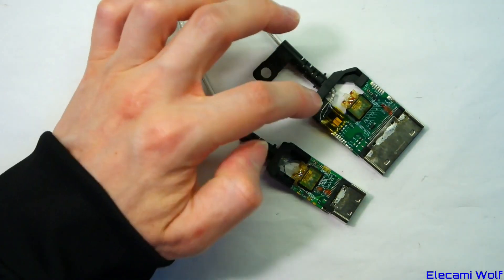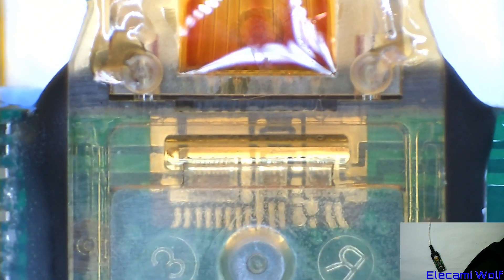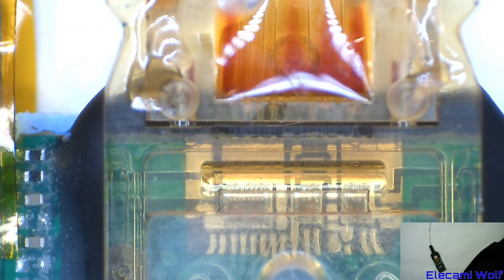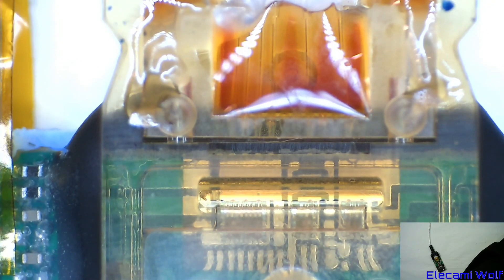Finally, let's take a close-up look at these things. I have a microscopy setup, so we should be able to get a look in there. It's using a VCSEL — a Vertical Cavity Surface Emitting Laser — so pretty much a laser diode die which is placed onto the circuit board and fires upwards. And then this component, which you can see there, is placed on top of that, and down the center there where there's an indent is an angled part which reflects the laser light outwards towards the top of the screen, where it is put into the fibers.